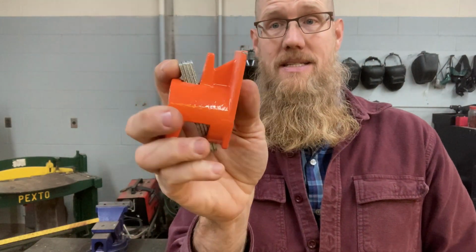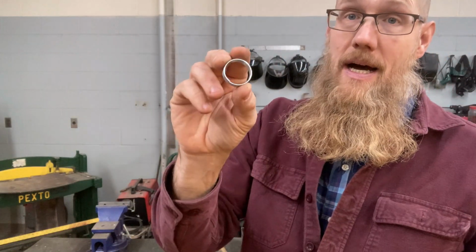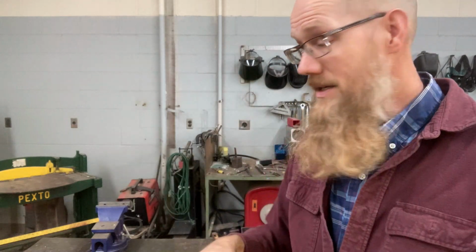With that kit, you also get the end piece, and this has a stack of shims. There's 4 little shims. There's a spring built into them. They're a little challenging to get on, but you slide those over the end of the pipe, and together, those make your clamp. With these Jorgensen kits, you do get a little end cap. This will go on top of your threaded end of your pipe. So if you bought 2-foot pre-cut pipe that's threaded on both ends, this would be there to keep that spring-loaded part from falling off. We won't use these, but they do come in those kits.